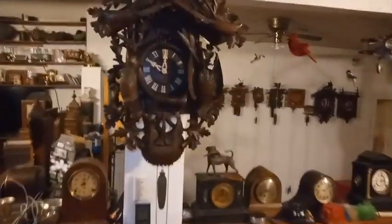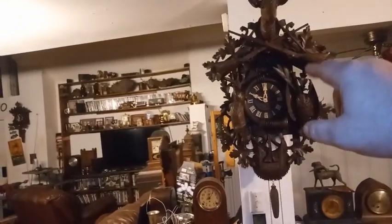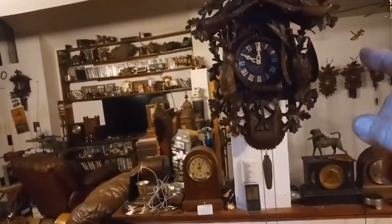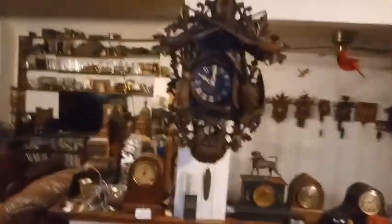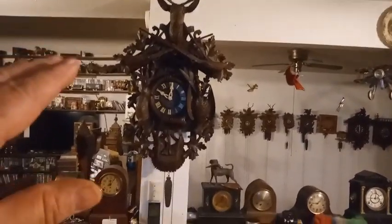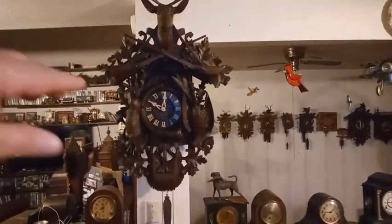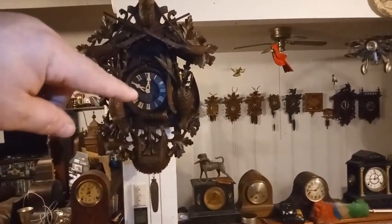Let's recap what was wrong with it. The wire that comes off the lever that is tripped by the minute arbor — the center wheel, one of the two pins — that wire goes around and comes over the second wheel, then has a tail on it. Originally I cut that tail too short. I discovered that for this particular clock, the third wheel warning pin has to go on top of that tail, so the hump that goes over the second wheel stops that third wheel warning pin when it's in warning.